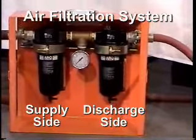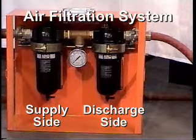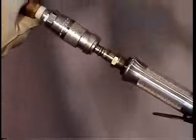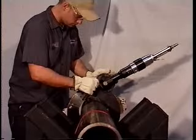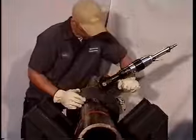The air filtration system supplied by Aggressive Equipment features a filter system, a liquid-filled gauge, and an oiler. The split frame requires 90 psi and 90 CFM. The Aggressive Equipment air whip features a dual locking system with ball valve. Air motor can be attached in several different positions. Trip assembly should be engaged before operating the split frame motor. To begin operation, engage motor.